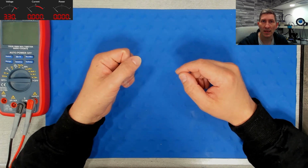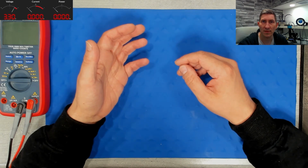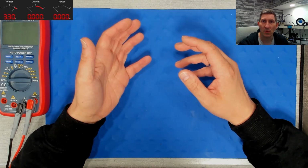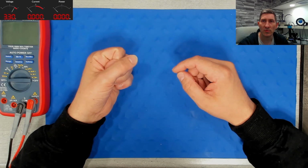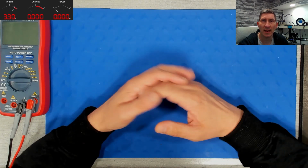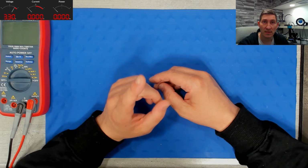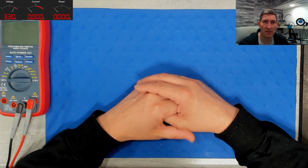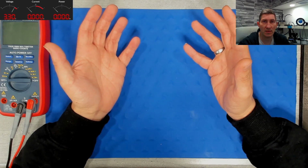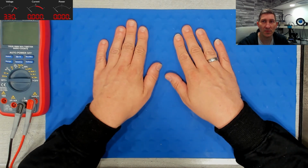However, in this circuit of this laptop, and maybe even in any laptop motherboard I've looked at so far, I've never noticed any diode after the coil. So I strongly guess actually the second MOSFET does the job of the diode. Unfortunately, I cannot test it anymore because it is already sold, but it was very interesting to talk about this again, because I'm not an engineer, I'm just an amateur. So thank you for your feedback, and let's see what I have for you today.